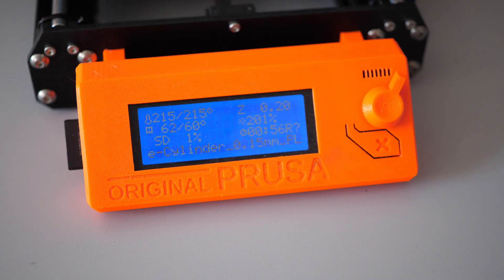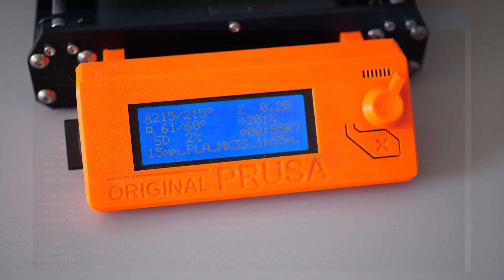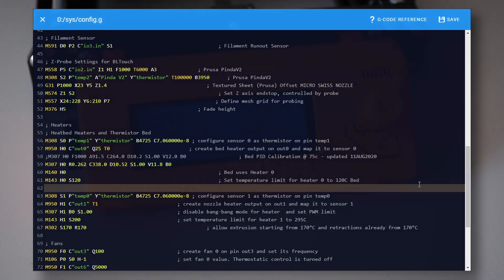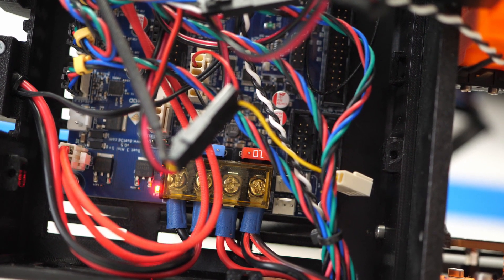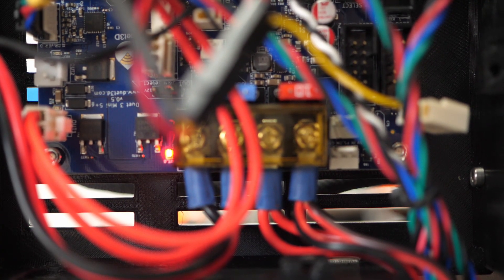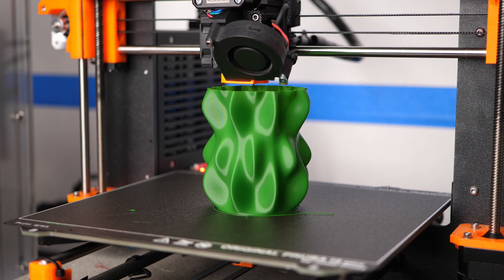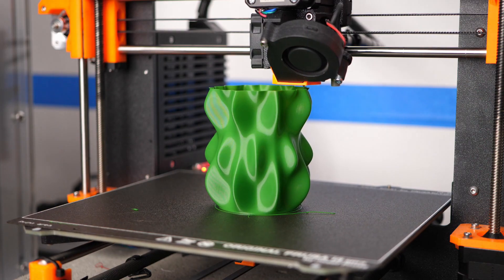If that's the case, you should first check if your printer uses PID control or bang bang. If you have access to your firmware source code, you can check the used algorithm there. In Marlin, it's in Configuration.h — if those lines are commented out, you're using bang bang. In RepRap firmware, check the M307 command for the bed heater: if the parameter B is not set or is set to 1, you're using bang bang; if it's set to 0, you're using PID. If you don't have access to your source code, some boards have indicator LEDs on the bed connector — if it's rapidly flashing, it's PID; if it's on for a while then off for a while, it's probably bang bang. If you find out you've been using bang bang, you can consider changing the algorithm to PID. If there is no way to change that setting, unfortunately there is not much you can do.